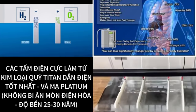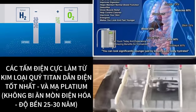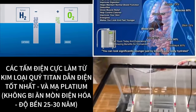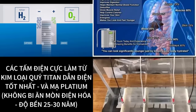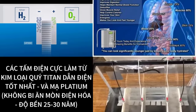As pure water is not a good conductor of electricity, something like salt is added, not a very environmentally sound method. If you use a proton exchange membrane, PEM for short, it's possible to extract hydrogen from pure water, as the membrane provides the necessary particle transport between anode and cathode.